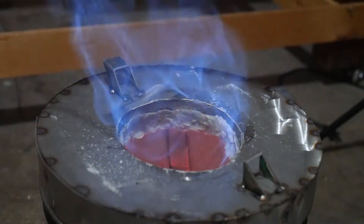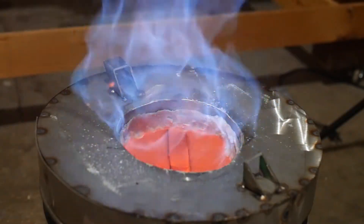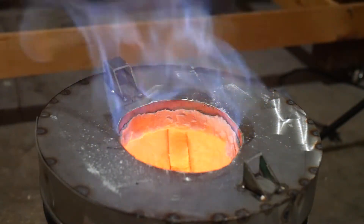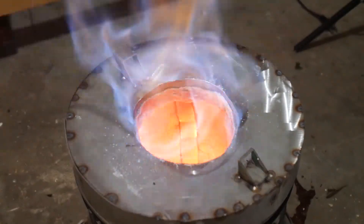As I noted before, you want the flame to be loud and aggressive like a tiny little jet engine — not like a campfire. The flame should be blue and not orange, which means you have enough air or oxygen flowing through the system. If at this point it's just going at a whimper, you need to adjust before you move forward.